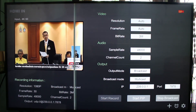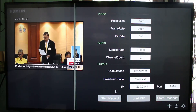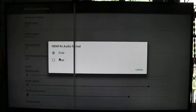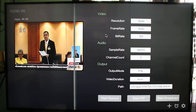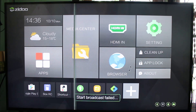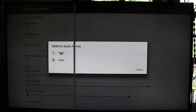At the beginning I had some problems — audio was not working well — so I tried different settings. You can set HDMI Rx to RAW, which means in theory you can record AC3. I also set video recorder to HDMI pass-through and played an AC3 video, or just used PCM. In both non-PCM cases, when I pressed Start Record it said 'Start HDMI In Record Failed', and Start Broadcast had the same problem. So if this happens to you and you don't know why, check the audio settings and make sure you set it to PCM.